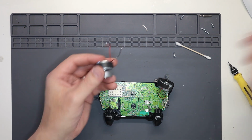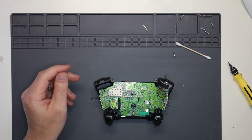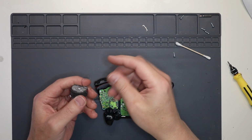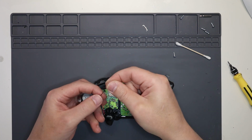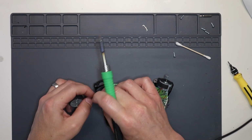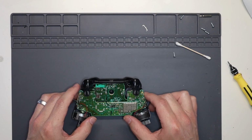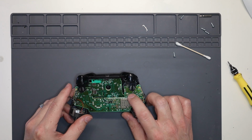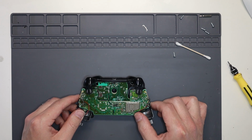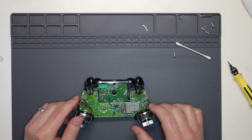Right, so this is what I mentioned earlier. Someone's actually broken that cable and resoldered it. So what I'm going to do is give our customer another motor with a proper unbroken cable on it. Don't like putting broken cables back into things. Fold those cables over. Yeah, that is really unfortunate. Whoever did this job before was really bodged changing the actual joystick in this. But we'll just test it to make sure it works. Customer didn't ask us to change that, so we'll test it, make sure it works, and if it works, great, we'll leave it as is.